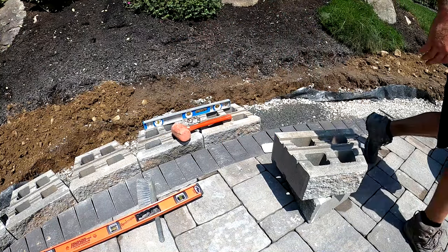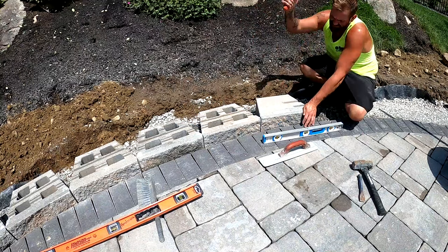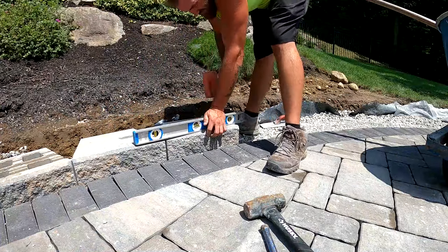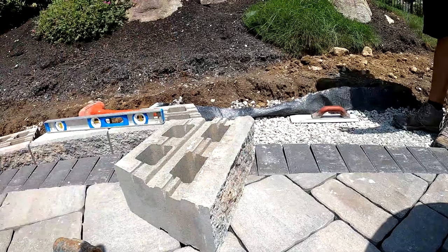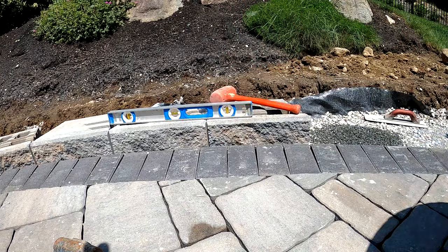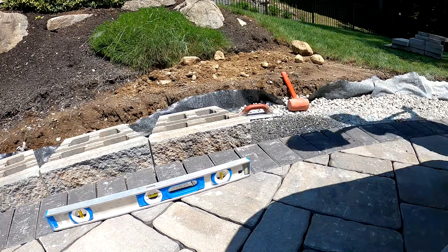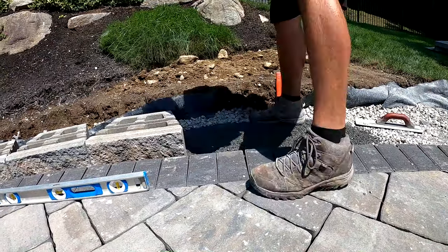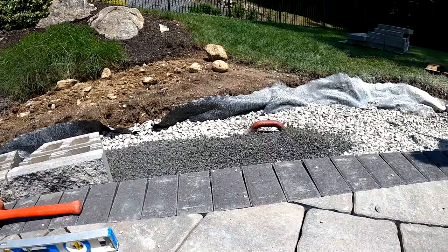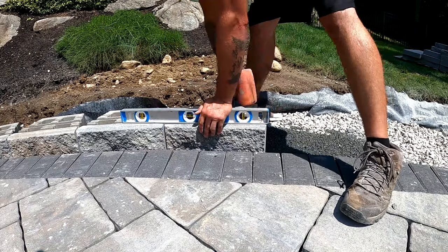I'm building the first row right now. Any wall builder will tell you — with block walls, this is really the number one part. You take your time and make sure the first row is absolutely perfect, and then the process from there is pretty simple: you just stack block on your well-done first row. But as you'll see in this video, there are some important things to think about when building a curved wall, especially when it's double-sided. The first two rows are pretty much buried, so there's no need for a double-sided finish there, but the third top row will be seen from behind, so we'll customize those blocks.